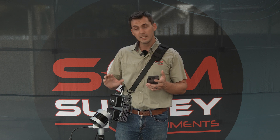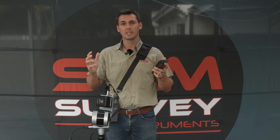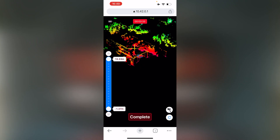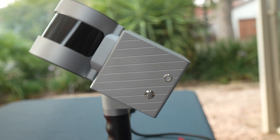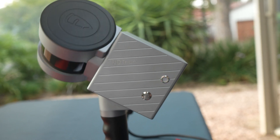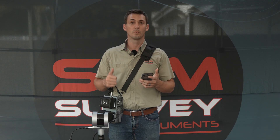While you wait, the scanner needs to be static and still, and also accumulate the most amount of data from the environment you're about to scan. In this case you might see the cameraman in front of me and a bit of our surroundings. The light is continuing to flash green, which now means our scanner algorithm is initialized and we can actually start with our survey.